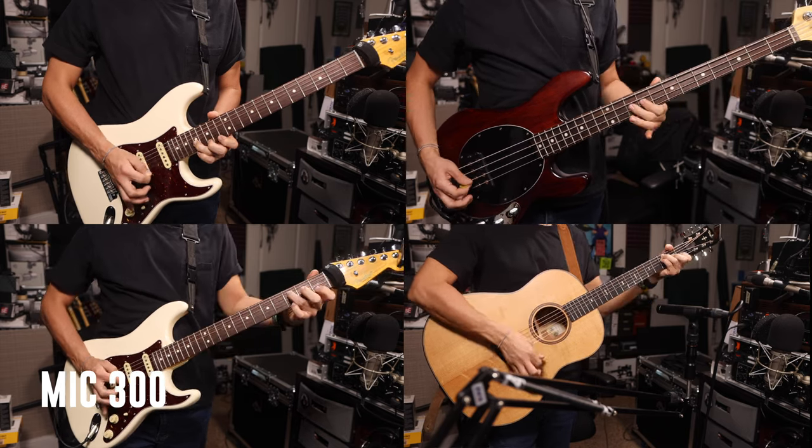For $80, you really shouldn't be expecting much out of your analog tube preamp, but one thing you are getting is a bit of fun. And first up, as far as pros, the preamp offers a pretty good amount of gain, where you get 60 dB on the preamp, and then you can add an additional 10 dB at the output stage. And I also like the fact that it has an analog limiter. That's the main thing that drew me to this device.